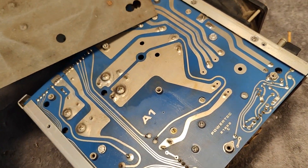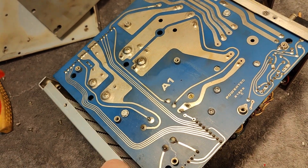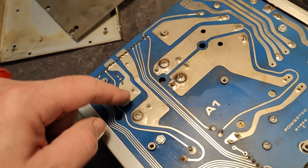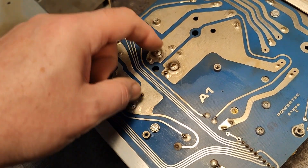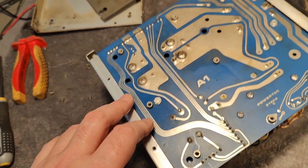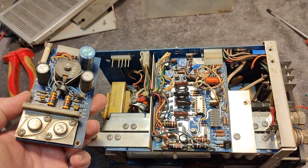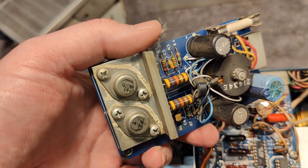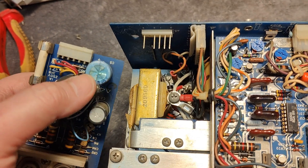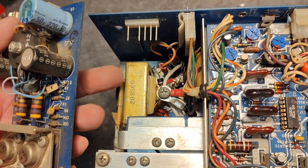The corrosion — it's from that screw. And that will be this little funny capacitor. There's a filter here — it's an inductor, a common mode filter between those two capacitors. That is a very good design. So there will be a rectifier somewhere here. Here's a little auxiliary power supply, I would imagine. And to create proper isolation distance, they've added glue on top of this capacitor to give distance to that one.